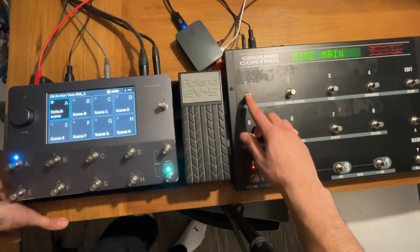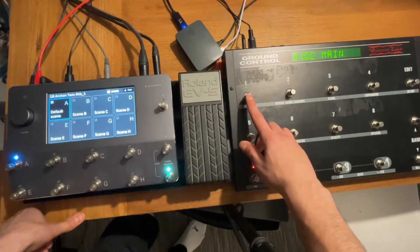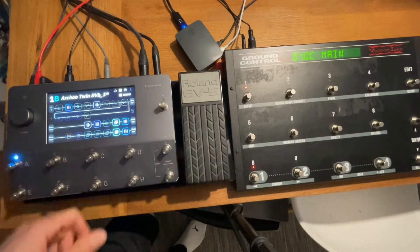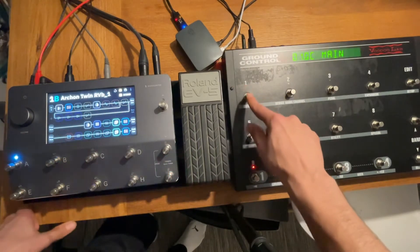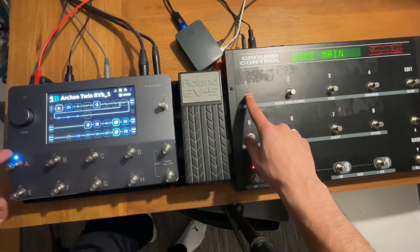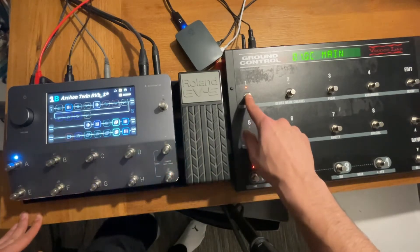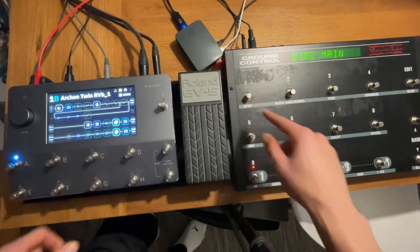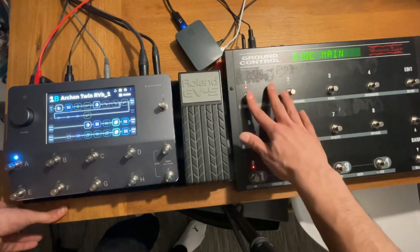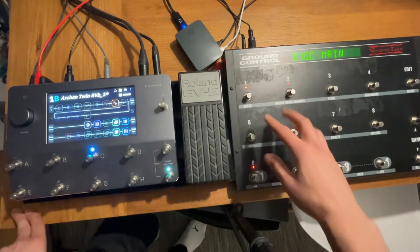And then I'm able to turn on a block from my stomp. If you look closely at the screen, you can see what's actually going on. If I click on one, it's now on — or off, because it was already on. What's happening is it's sending a series of MIDI signals: it switches to stomp, enables or disables whatever block you have assigned, and then switches back to scene. So you don't have to do it manually. You can assign it to different things, like your equalizer, and it still remains on the same scene. If you switch scenes, you can turn it on and off again.